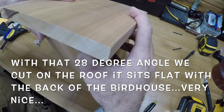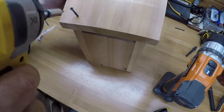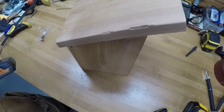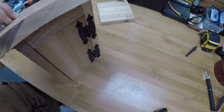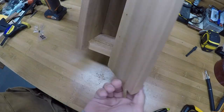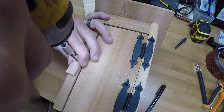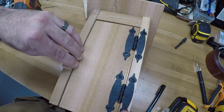Now putting the roof on, ballparking the overhang on both sides, and putting in four screws, pre-drilling again so we don't split the cedar. Hit a knot in the upper right corner — the screw didn't want to go in, so I lowered the hole and redid that screw. Little imperfections add character. Now putting a little lock on the door — this is your clean-out access. All that's left is to put the entry hole in so the birds can live in this thing.